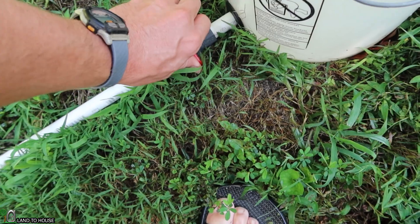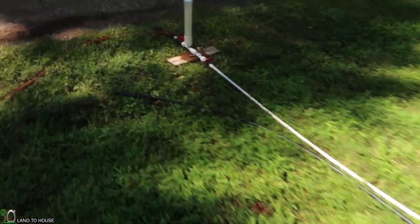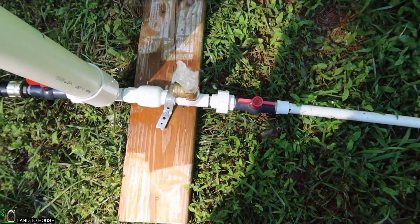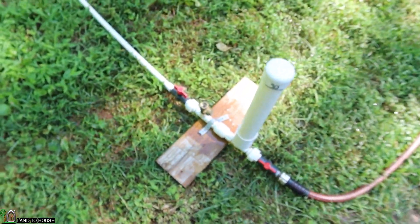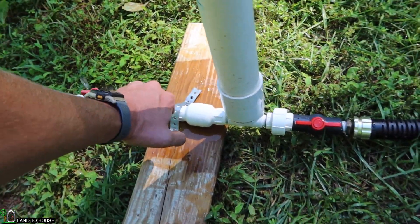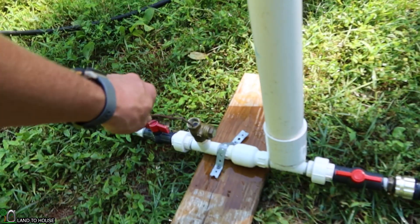Turning on the drive pipe will fill it going down to the pump. I need to make sure I get all the air out of the line, so I'll open the valve down here — it's going to bubble a bit to get that air out. Sometimes when the valve closes there's still air, so I need to purge it by holding this down. A stick can be helpful to purge those air bubbles out.